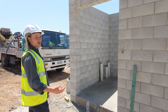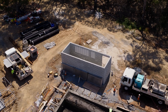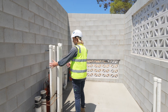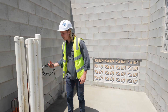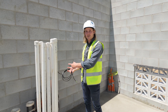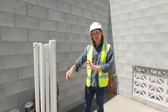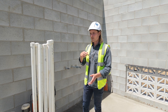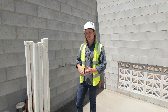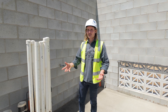We've already run the pipes through the ground and up through the slab — these are our pool pipes. We've already run all our light cables and everything. We do this to make sure we can actually get the light cables into the pool. Say you run conduits on 60-metre runs and you can't get your light cable through — you're in big trouble. So we run the light cable and pull it through to make sure we can do it again. Because if you ever have to replace a light, which happens, you need to be able to get it through those conduits. If you hit a stuck point and can't replace it, you're screwed.